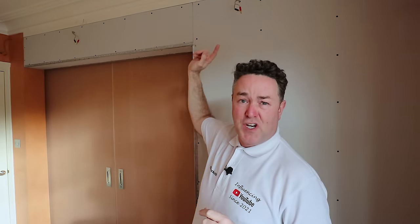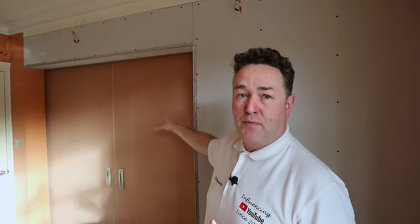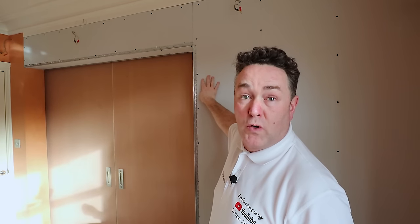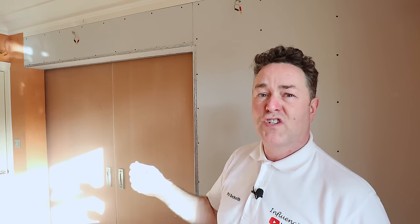Good afternoon followers of the channel. I'm always one for trying things out in my own house. We've had a little bit of work done — we had an opening where our lounge was, a through-lounge with an RSJ support going across the middle. We've had it boarded up with proper stud work, insulation, plasterboard, and two sliding doors fitted on a barn runner. Now we've got bare plasterboard, and I've told the joiner to just board it out because I'm going to use a special product that I will skim out like a plasterer.